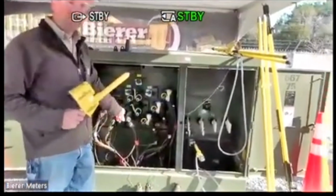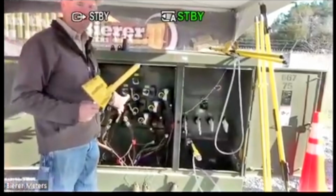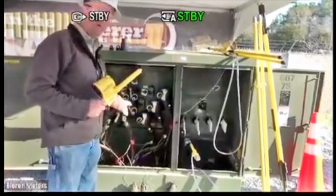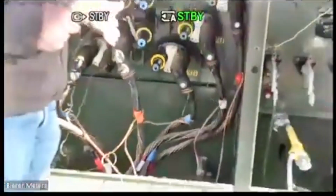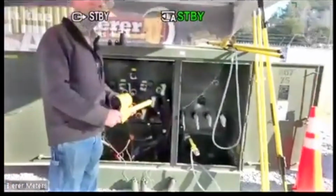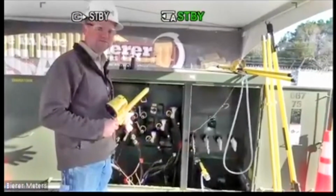And I'm going to cheat a little bit here. Normally, you guys wouldn't have any tape maybe in the field, so you really wouldn't know what cable this is, but it's attached to this cable we have taped orange. So this cable is already stood off. It's on a feed through, okay? And I'm going to use the meter probe with a bushing adapter and find that potential, okay?